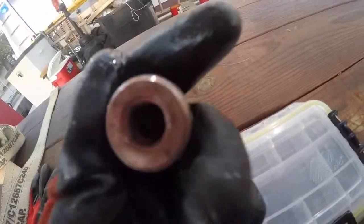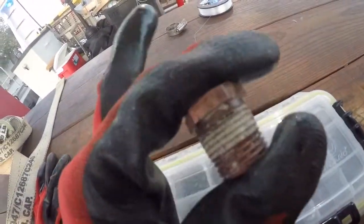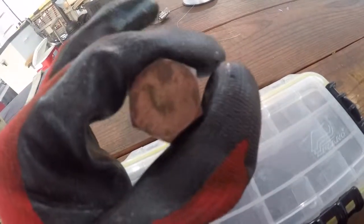This is a completed plug. As you can see, there's some slight discoloration — it takes on more of the color of a penny after this. It's cleaned out. This right here is a sealant I use for this plug as opposed to thread tape. This is a clean zinc, and I've been doing this to my zincs for about a year and a half. I'm not responsible for any damage you may cause, but this method has worked for me. It saved me hundreds and hundreds of dollars in zinc plugs, not to mention a major hassle.